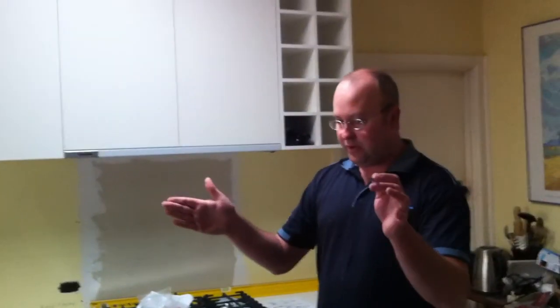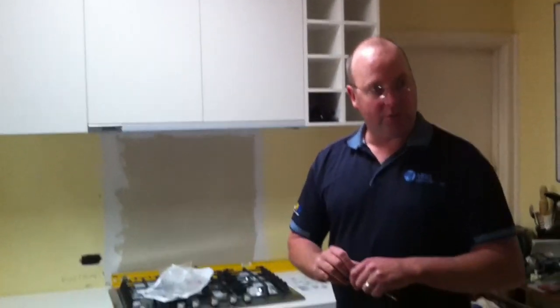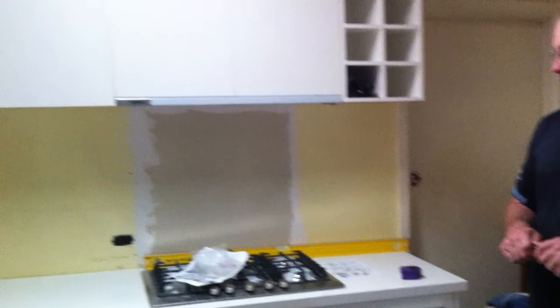and then you correspond that to your rakes. And if your rakes don't quite add up, you might need to tweak a mil here on the rake or tweak a mil there on the rake to make the panel work, or just double check yourself at the levels and go, oh shit, that was a 4 mil run out, not a 5 mil run out, or whatever it may be.